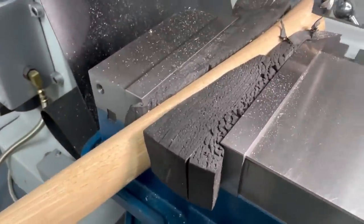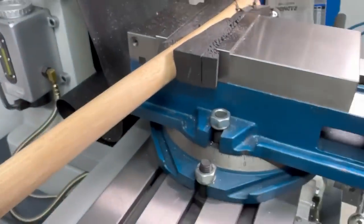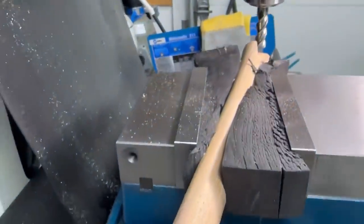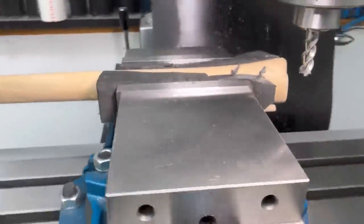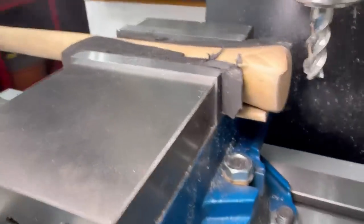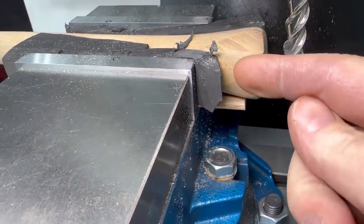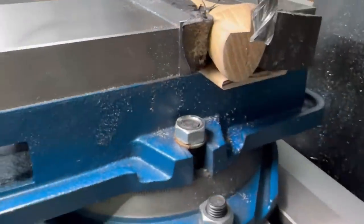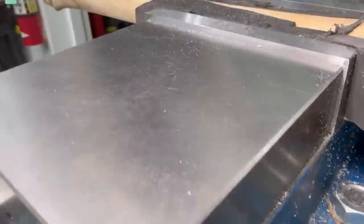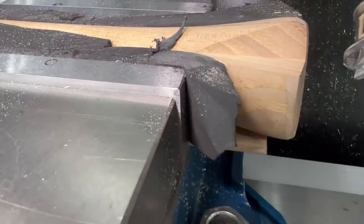I used some very high density foam. It is tipped on an angle and rotated, and it is also raised on this end down here to get that thing at a point where I could cut a 90 degree notch in it and have the run out not go clear down the handle, but just enough to clean out the chip, or the notch that was cut out of that.